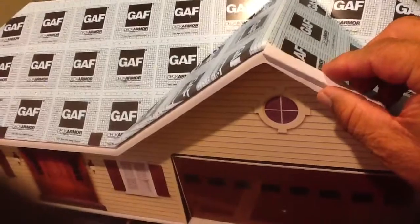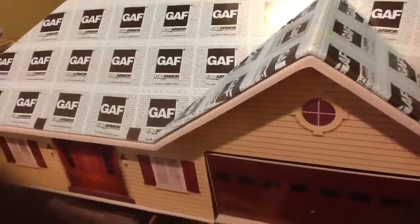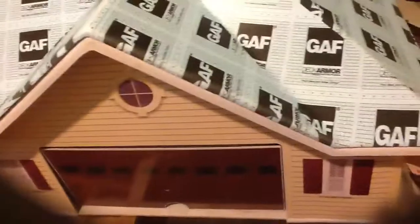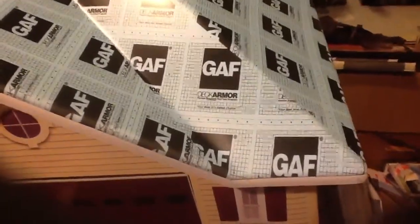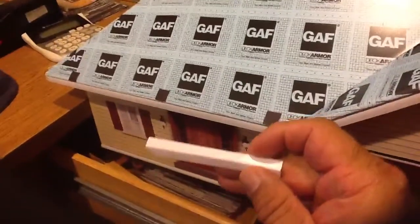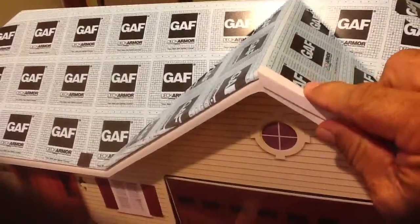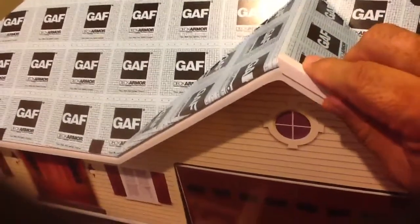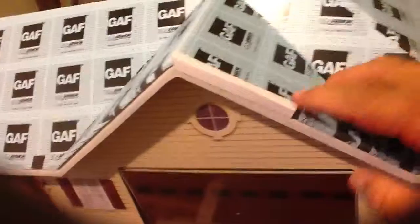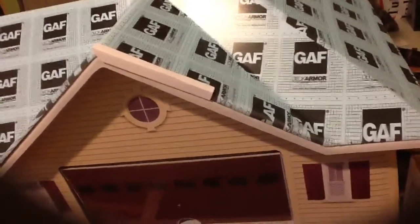I took in, bent a business card, Askaroofer.com, and kind of give you an idea of what it would look like. Typically the fascia down in here, along this edge here, across the front, this drip edge would go up underneath the felt. But on the rake, what we're talking about today, it's going to go on top of the felt, setting that right in there after the 30-pound felt or the synthetic underlayment that you put down, and it would run all the way down to the beginning of the roof, and that protects.